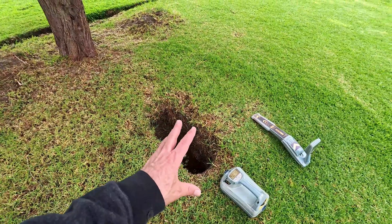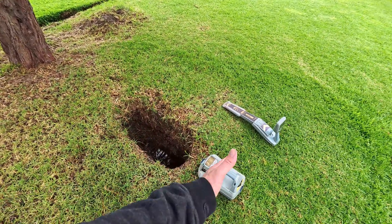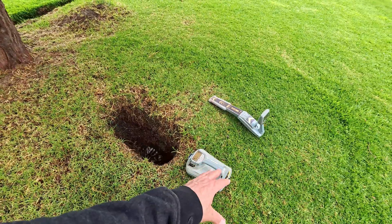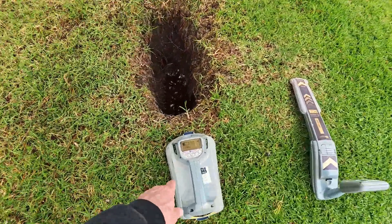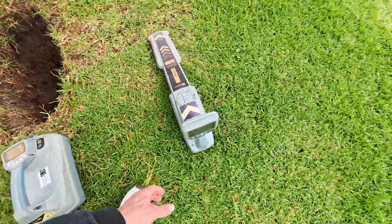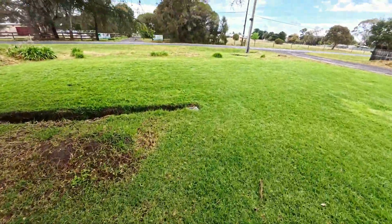The whole point of the video was that if you can't dig down here, what you do is place your transmitter back where you know where it is — just in case it turns or does anything else — and you jump onto 200 kilohertz and grab a locator.